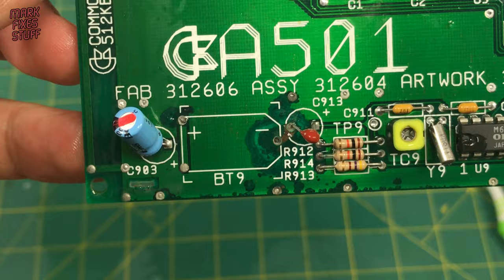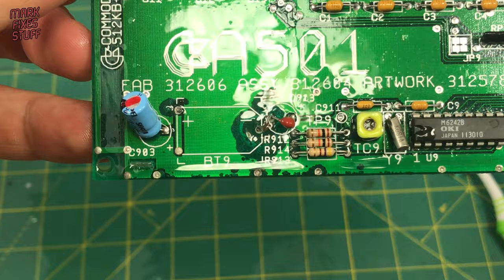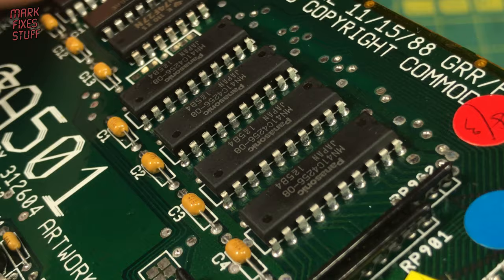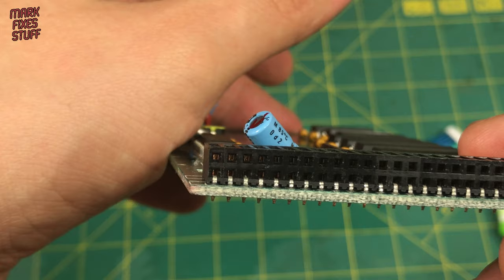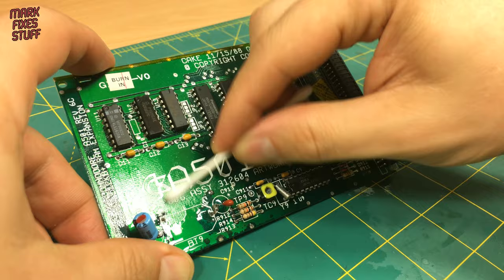This is cleaning up really well. Looks like Ville Lord Such's Amiga expansion has really dodged a bullet here - this could be so much worse. All the chips seem fine with none of the bluey-green flecks you'd expect to see from airborne leakage, and the connector looks fine too. IPA naturally evaporates quickly, but for the sake of expediency, we're going to dry this off with a cotton bud.